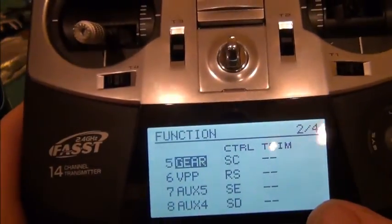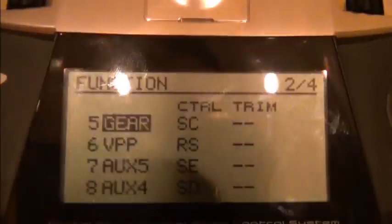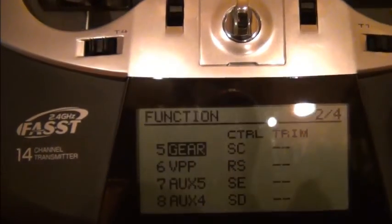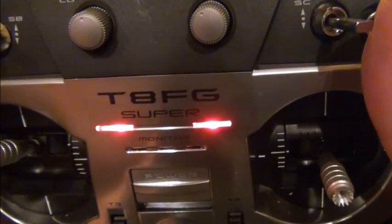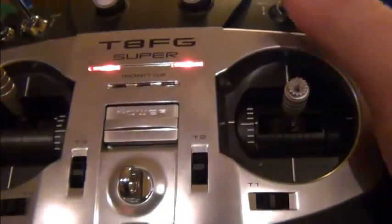You can move the mode switches around but this mix might not work, so be careful if you're going to do that. To force failsafe, always plug it into the Naza and the computer to double-check your work afterwards to make sure that it goes to failsafe. This works on failsafe for manual — you can go directly to failsafe, altitude hold directly to failsafe, or GPS hold directly to failsafe — forced failsafe, come home and land, even with it on manual mode.